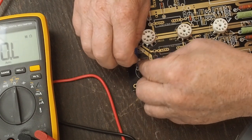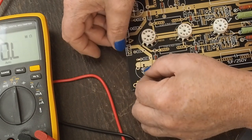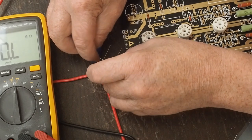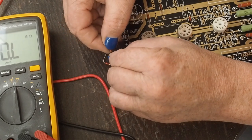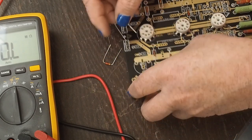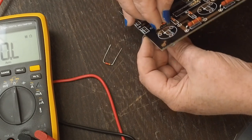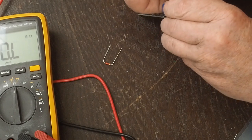And like this little resistor here, you could use these little short ones like I've got and use these first two holes. But it's also got a hole over here in case you get the longer type resistors, which are fine too. I would populate this thing. I never go below a 1 watt resistor, because now they make 1 watt resistors that are almost as small as what 1/4 watt resistors used to be. And I think in audio signals, you don't want a really small rated resistor with the audio signal going through it.